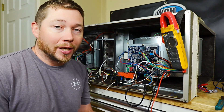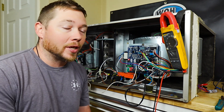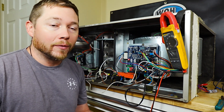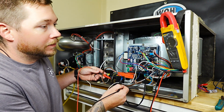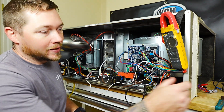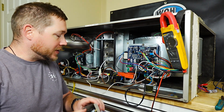That was our chance to go to the outdoor unit and find out what's going on. Is it the wiring coming in? Is it the wiring next to the compressor on the high pressure switch, low pressure switch, whatever? Let's go ahead and check the contactor — that's where our problem is. Let's go ahead and replace the contactor since we have one here and run the test again.